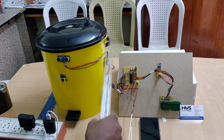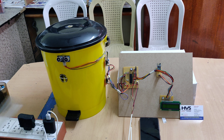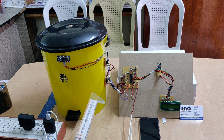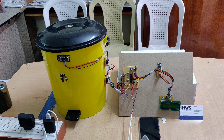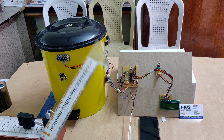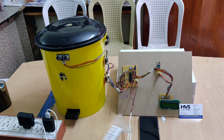The output of the distance sensor as well as whether the dustbin is empty or full will be displayed on a 16x2 LCD. Additionally, we are going to send the dustbin level through the ESP8266 module to the Blynk app, where a vertical level presentation widget will display whether it is zero, off, or full.